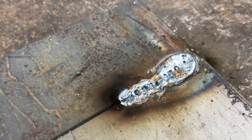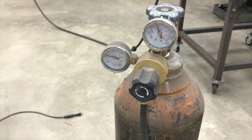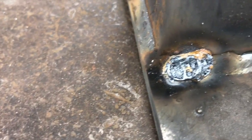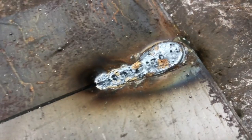The first thing I want to show you is a close-up of this weld. You can see it was welding along pretty nicely there, and then this happened. What that is caused from is when you run out of gas or you forget to turn the gas on. If you're in the middle of the weld and everything is welding fine and you run out of gas, that's what you'll end up with — something moving along great and then all of a sudden you get that mess, with all the porosity in it, the pits and holes.